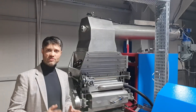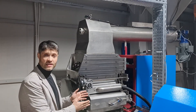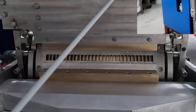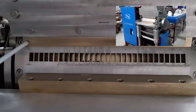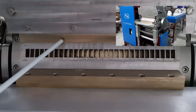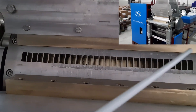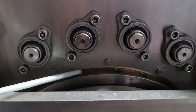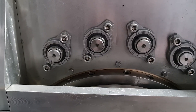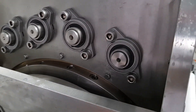The CubeSugar production process starts with the pressing unit. At the minimum contact points of the mixer and the mold, all the aids are made of a special bronze — an aluminium-nickel bronze alloy. All sides can be fine-tuned so that the gap is minimal. Thus, the small granulated sugar crystals in the mixer don't come out of the contact points and there is no product wastage.